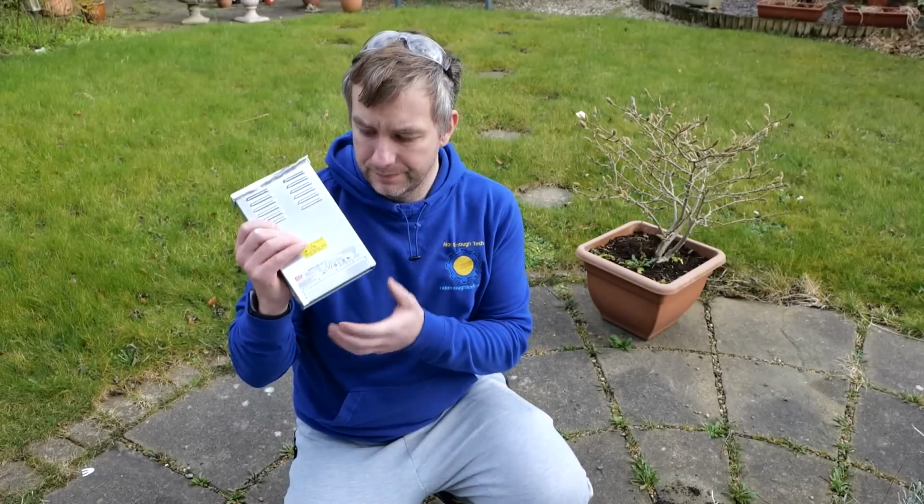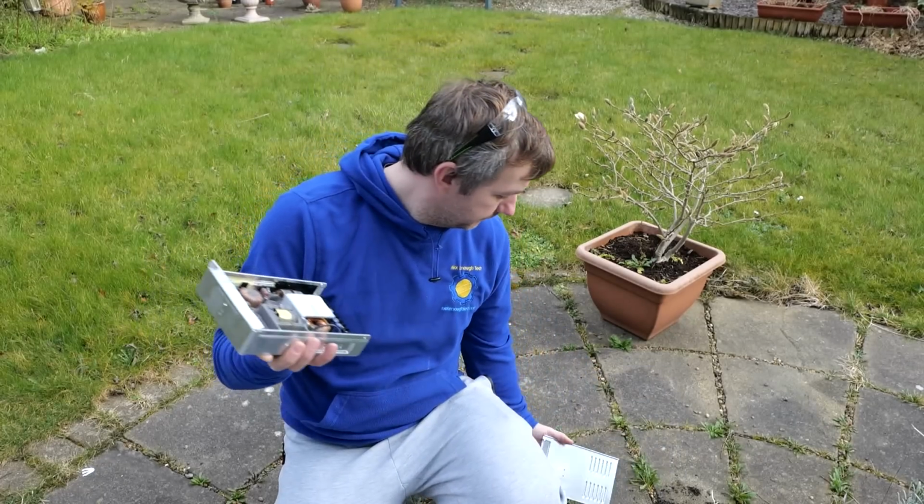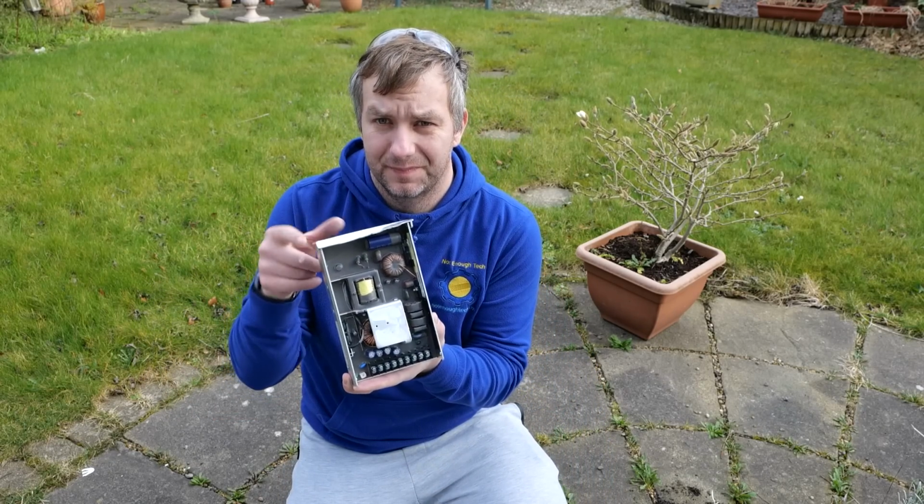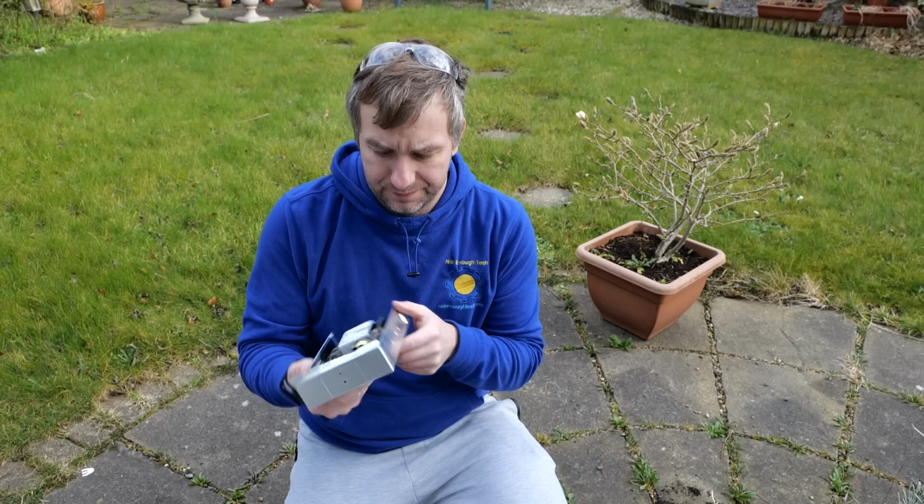Now the fan is still there. There is still a 60mm by 10mm fan inside, but I have another approach. Instead of going Noctua and picking a 60mm fan, then trying to fit it or maybe move the power supply to the side or create risers, there are multiple different approaches. I thought I'm going to try something else. I've discovered that there are 400 watt fanless power supplies that are just about the right size for the Ender 3 V2. So this is what I got.